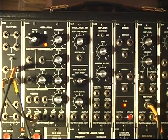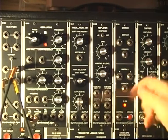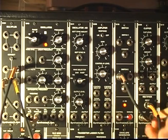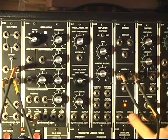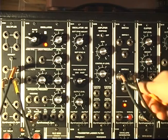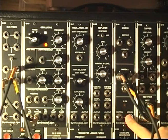That got me thinking about the switch - I haven't messed with it much. I could plug the positive output of the rectifier into one input of the switch and the negative output into the other input. Now if I want to hear the positive output I don't do anything, and if I want to hear the negative output I just push the button. Here's the positive output - oh, it helps to plug it in - that's positive, that's negative.